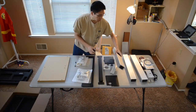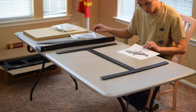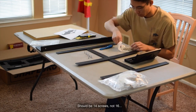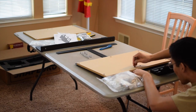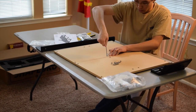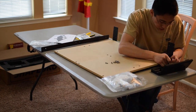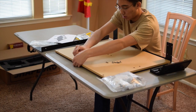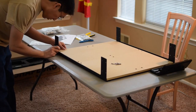Assembly of the Shapeoko is broken down into six major steps. Step one is to set up your base frame. You'll need to lay out your frame straps, align the threaded holes with your waste board, and loosely screw the pieces together. Next, you'll add your front and back end plates — align your bolt holes and screw together loosely. You'll need to align the base frame with your Shapeoko rails later. I'd recommend nudging your front and back end plates as far apart as possible to minimize the chances of scuffing up the powder coating when you drop in the rails later.